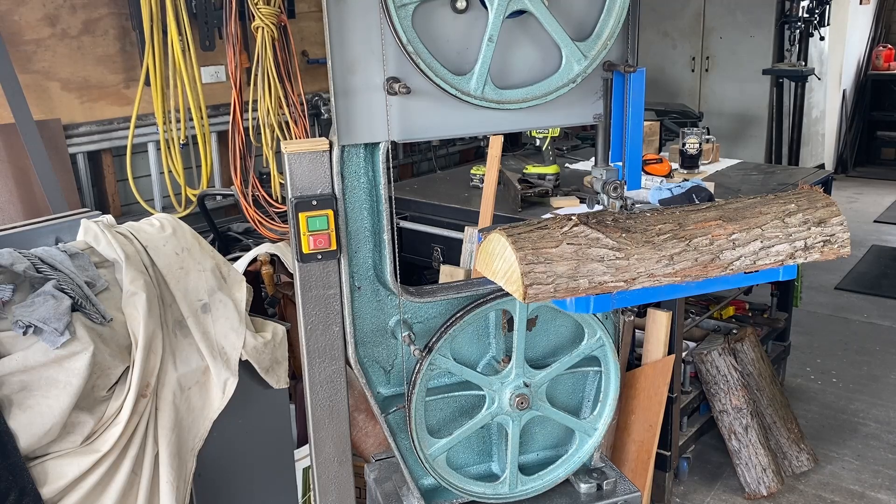This is the setup for the test. I'm going to run two tests — one without the dust extractor attachment and one with it connected. I've cleaned the machine down on the outside and inside to remove all dust, and I've cleaned the floor as well — the same process at the beginning of the second test. For each test I have two pieces of wood: one for cutting crossways and one for long grain cuts from the end. In total, both tests will have 50 cuts each and the cuts will be the same in each test.